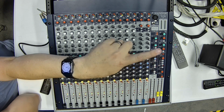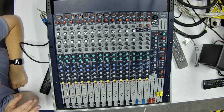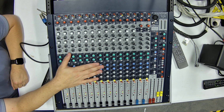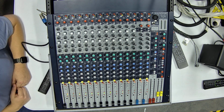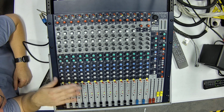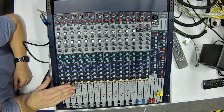The signal that comes off of these little microphones is really, really tiny, like it's in millivolts. When we get into an analog line-level mixer like this, you tend to want the signal hovering around 1 or 2 volts. The nominal operating level is actually 1.23 volts. When the meter hits 0, that should be 1.23 volts. The signal coming off the microphone is tiny, little millivolts, and you want it up at 1 or 2 volts, so you have to amplify that voltage. That's what the preamplifier does.